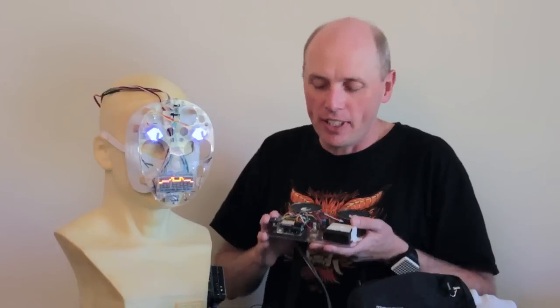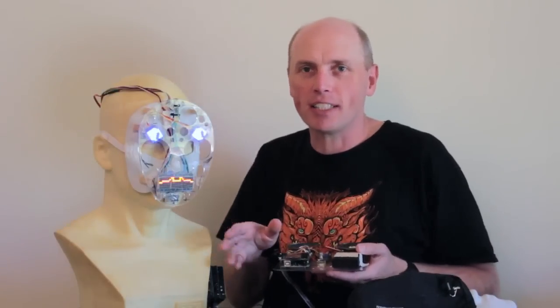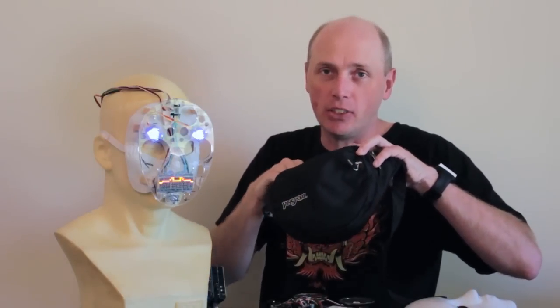What you didn't see during Show and Tell is there were actually a lot of electronics strewn all over the desk. So what I'll need to do before Halloween is fold all of that down into a belt pouch along with batteries. An important bit of advice there is to use two battery packs — one specifically for the speaker amplifier, and one for the Arduino and the other electronics. The reason for that is explained in the voice changer tutorial, so check it out.